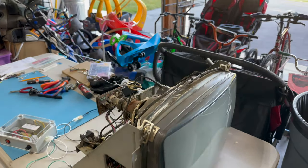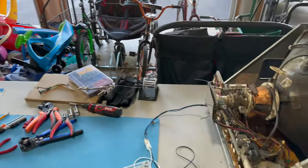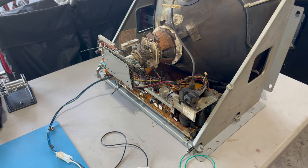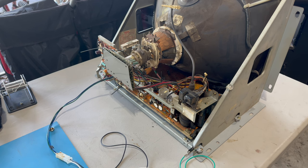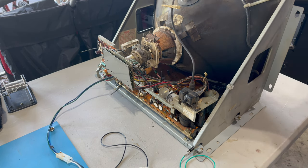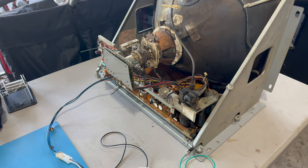So let me actually look at the back of the monitor, because if there's any kind of problem, that's where it's going to be. So keep your fingers crossed that we don't get a smoke show or anything like that. But I think we're ready to go. So 3, 2, 1. I hear the HV. Nothing on fire yet. Okay. That's a good sign. No capacitors exploding for being in backwards. No signs of smoke. We're getting a little bit of a hum, but I've read online about people having that. There's a transformer on the chassis that vibrates at a really high frequency.